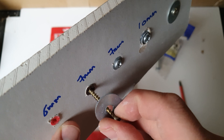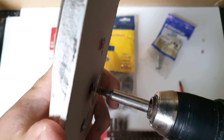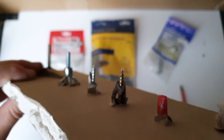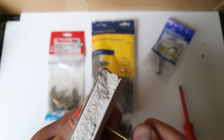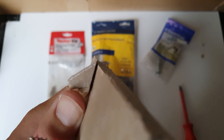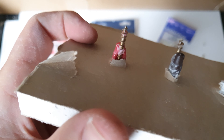For the Unos, I'll go for the seven mil first. I've got a washer as if I'm using it as a bracket, so obviously you'd be screwing something to the wall. As these screw in, on the back you can see they've pulled themselves down — that's what makes them a plasterboard fixing. They compress down and then wedge out. I'll do it again on the red one. You want to get these in nice and square. You can see it's bulged out — pulled back — and I didn't even get that one fully square and it still pulled back.